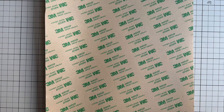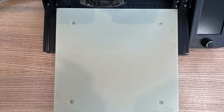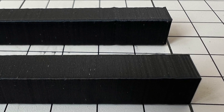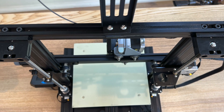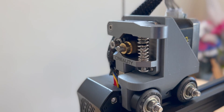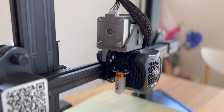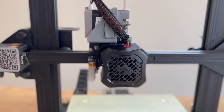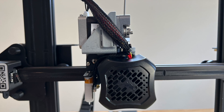I got a PEI sheet and pasted it on the heat bed directly. In theory, without the heavy glass bed it vibrates less, and it should resolve the top layer shifting issue — and it did! Surprisingly, I also found ABS sticks very well on the PEI sheet, so it's going to be your ultimate ABS print bed solution. In my version 2 mods I also printed a direct-drive mounting plate. According to my experiment it does not improve print quality, but it does reduce retraction down to 1mm from 6mm. I think it's worth it even if it doesn't improve print quality since you pay almost nothing for it. I printed it using PLA Plus and it had been working very well — I did not see any deformation after more than several days of printing.